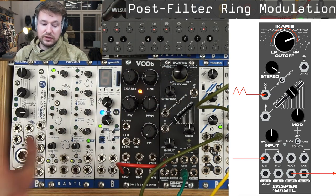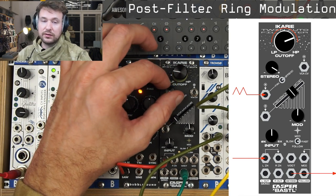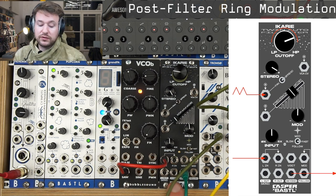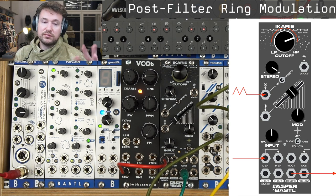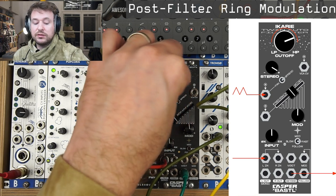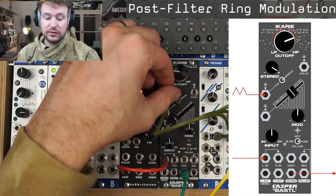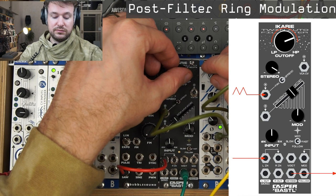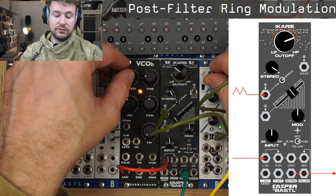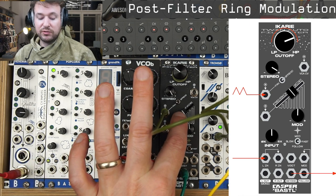It's not perfect because it's an analog circuit in the first place. And then to the left I'm making the sound louder, and to the right I'm also making the sound louder, but with opposite polarity, because one of the filters has the minus sign. That's how you do the difference. And basically you get, this is a ring modulator now. So if I use a fast signal, and tune it hopefully to something similar as the oscillator, maybe have a bit of resonance.